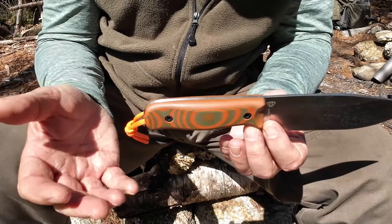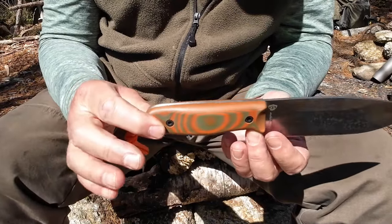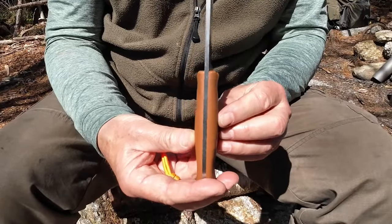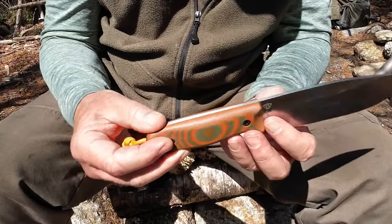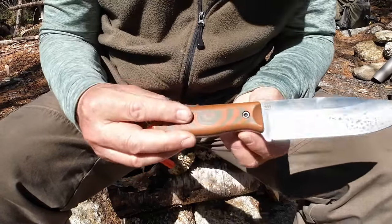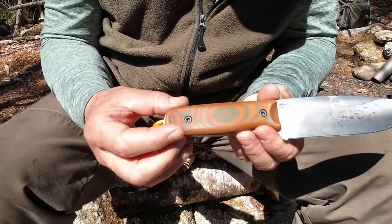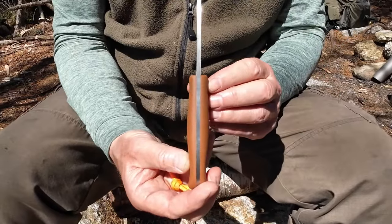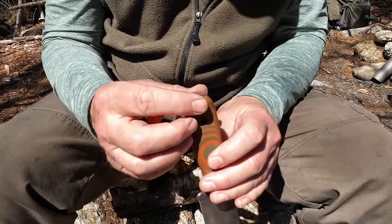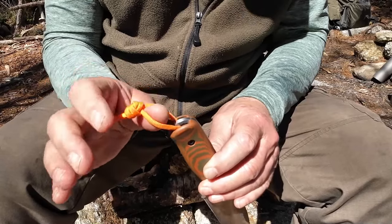What's the big deal with handles like this? They're not what you'd call dramatic — they're very simple handles. But it's because of that simplicity that gives them the versatility. The original French trade knives had simple, rounded, broom handle-style handles for the most part. This one goes that way but adds some improvements. There's a fair amount of belly in the center for a palm swell, repeated on the sides, but fairly flat-sided. There's a small choil for the forward part just behind the guard for a sense of security and control, and a little tapering at the back — a bit of that Coke bottle look. The rounded pommel and a hidden lanyard hole in behind keeps it out of the way. I have a little piece of orange paracord, with a slightly bigger loop — I'll explain why in a few moments.